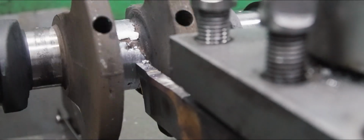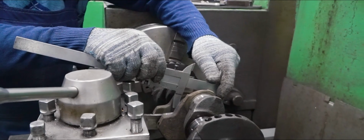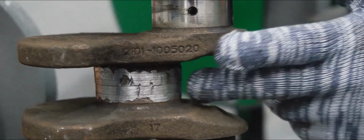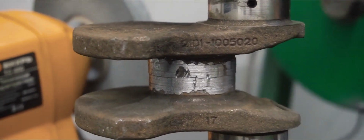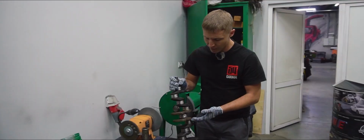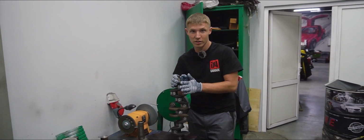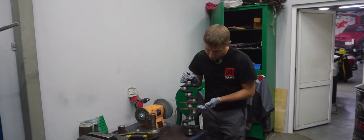Okay, we've welded up the crank, and even subjected it to a bit of grinding. We've removed any sort of crap, and honestly, this does not look all that great. I am not satisfied with my welding. It's not easy welding these types of items with a MIG welder. You've always got some kind of contaminants coming to the surface. Yeah, that's just how chemistry works. Cranks are made from high carbon metal, and with me using a normal sort of steel wire, the results are pretty atrocious. There's really no other way to describe it.